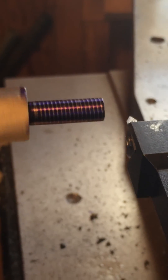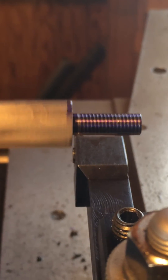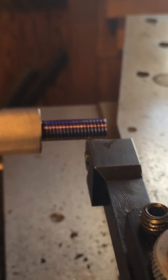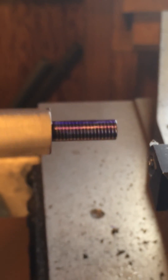Let's go and see how this works. Here we go. And it stops. Now, what I'll do is, using that lever I showed you, we disengage the tool and we move it the other direction. The other trip dog disengages. We re-engage the tool, and we go left, and right, and left, and right — and that's how you do threading up to a shoulder on the HLV lathe.